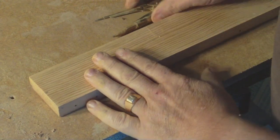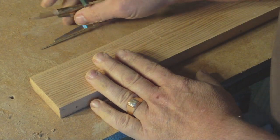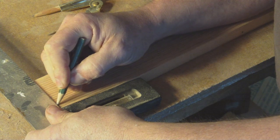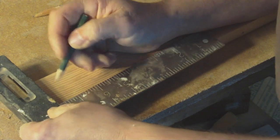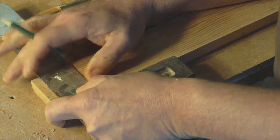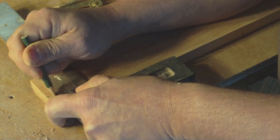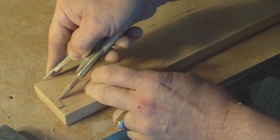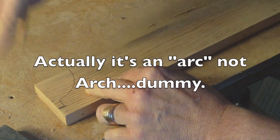Halfway through this project, I came up with an idea of something I wanted to add along the back of this desk — I thought it kind of looked flat. You see this detail a lot of times in historic pieces. I'm going to make this as an alternate piece; I may or may not add it. When I'm laying these things out, I've found that a small compass is really your best friend. I'm going to come up and in a step — maybe just a quarter of an inch — then come up the same amount. From there I open my compass up and swing this arch right on around.